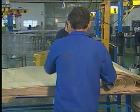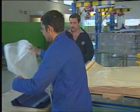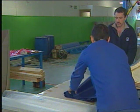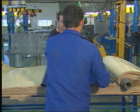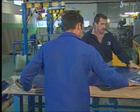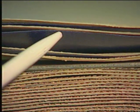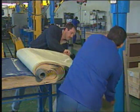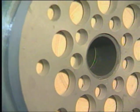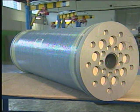The conventional solid spacer found in standard micro and ultrafiltration spiral wound membranes has a tendency to allow solids to build up. The 15-inch Graham Tech membranes are wound with the customized collapsible spacer intact. This spacer replaces the conventional feed channel spacer, separating the membrane layer and the permeate spacer envelope. Approximately 46 membrane leaves are wound onto the permeate tube, resulting in the unique 15-inch Graham Tech membrane size.